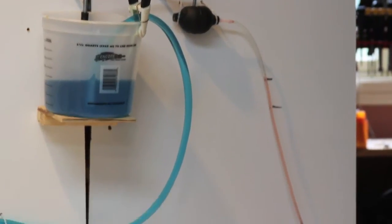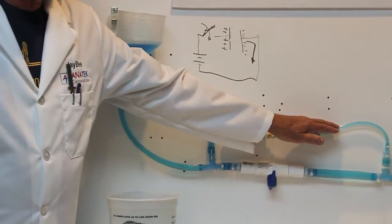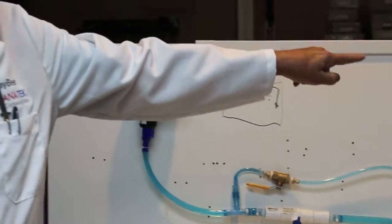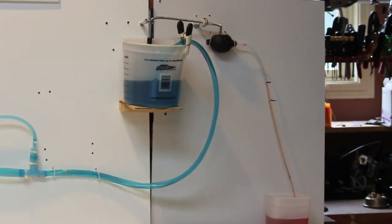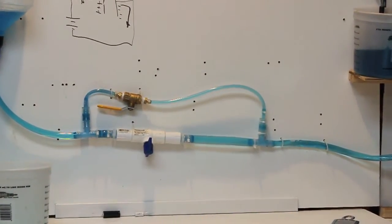And that is the precise point of this part of the experiment. With bigger resistance to current flow, the slower the capacitor charges. It's charging, the red water is going down, but it's going very slowly because we've got more resistance in the circuit. That's the point of the whole thing. And that's a very important characteristic. That's exactly how electrical capacitors work in circuits with resistors. The value of the resistor, the value of the capacitor, the supply source voltage determine how fast things happen, and that can be used in lots of really interesting and cool ways.